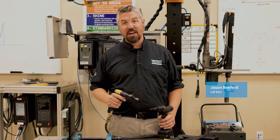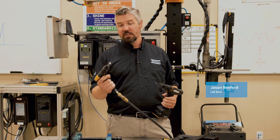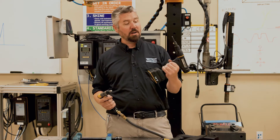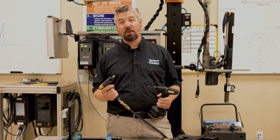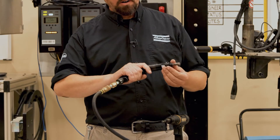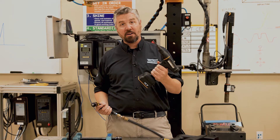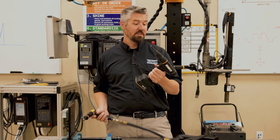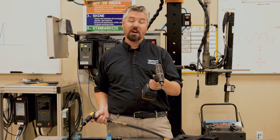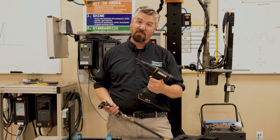Hey, I'm Jason. Today in the lab we're talking about industrial power tools. We're going to show an old tool and how we used to do assembly, and we're going to talk about a modern smart tool and how a modern factory assembles parts. Right here we have an air assembly tool — this is a clutch shut-off. And here we have a modern tool: it's got a transducerized torque sensor and an angle encoder, and can tell us if we did a good job of assembly and record the data to prove we did a good job.